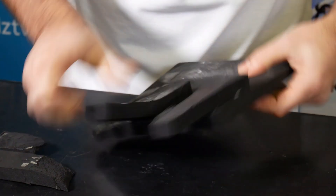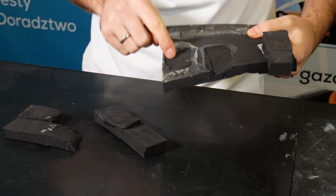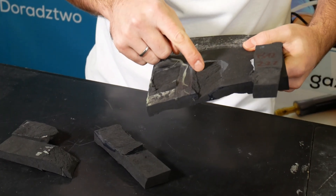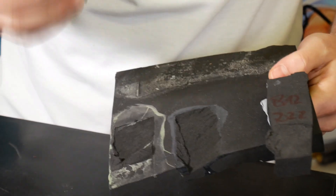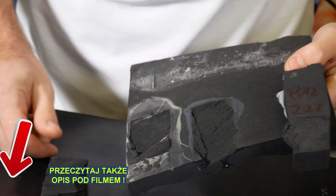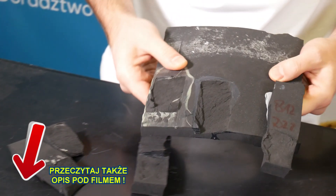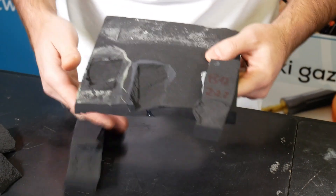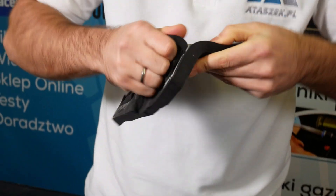Glue 901 shows the same effect. The only difference will be that the 901 adhesive is stronger on its own; however, when you add moisture, water, or glue to other materials, then the 901 glue is even stronger. U800 glue is best for large areas — such as soundproofing — or any other bonding as a fast contact adhesive. And glue 812 with primer 822 pulls out nicely, also pulling out this EPDM in pieces.